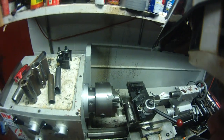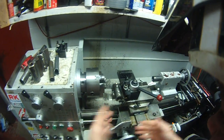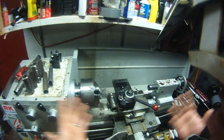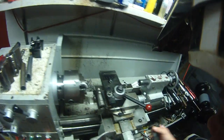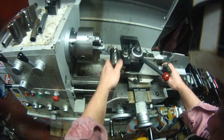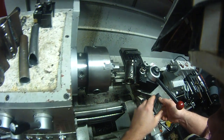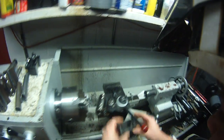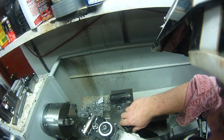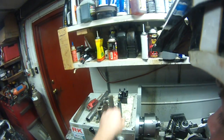So if we were going to do a straight cope, just tighten this down where it's already tightened down and you're good to go. But if you want to do an angle — say like 25 degrees or something — you just loosen this up, get yourself to 25 degrees on there, and snub that down. All right, now let's cope some tube here.